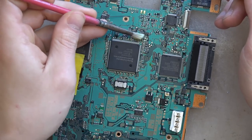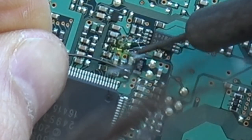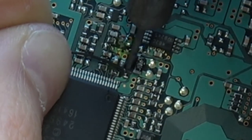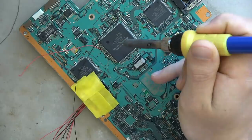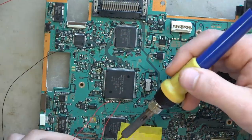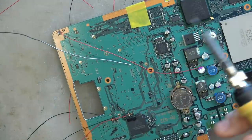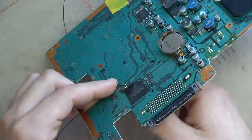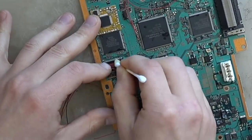It's the same thing: adding flux to all the different locations, tinning the wire. Right here we're soldering to a little resistor — some points you'll solder to a via; it all depends on your motherboard. But it's the same exact thing: flux down, tin up the wire, use the 3mm chisel tip to push down. It's the same as all the other points. We'll do all the different points on the entire PS2, and then once they're all done we'll get into wire management and get creative.